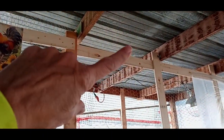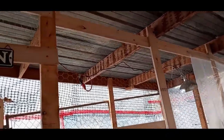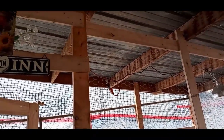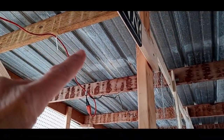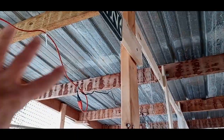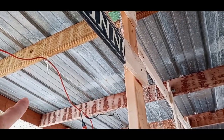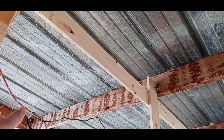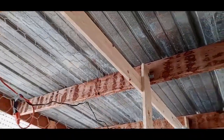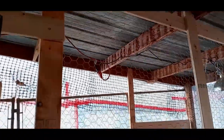So I think what I need to do is put a piece of plastic at least over that. Just makes me nervous. So I just got to measure and get my plastic, not from side to side, but most of it, and then the water can leak out because it's not leaking down the middle of these. A lot of it's leaking where the metal was nailed to the boards, and some of the nails missed, and there's nail holes. So I got to get that part figured out.